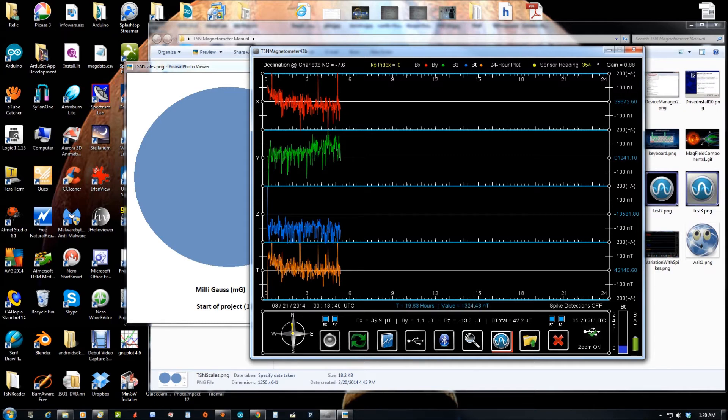In the 24-hour plotting mode, what is plotted are values averaged not only 12 times a second, but then 12 times a second over a minute — so you're getting minute averages times 12, meaning 60 times 12 samples being averaged. That was the key insight, thanks to advice from a university professor. I've been able to get down to this range, which is ridiculous for this sensor.